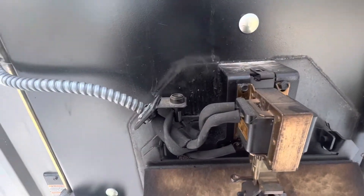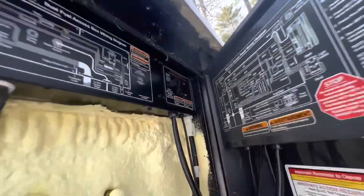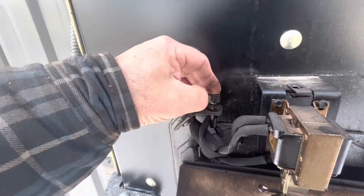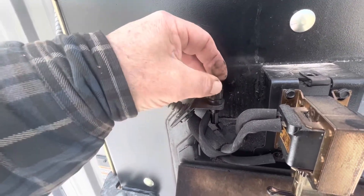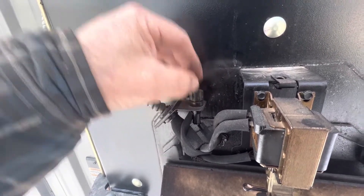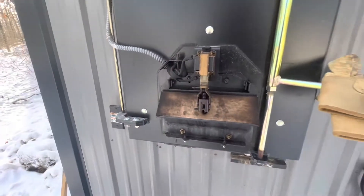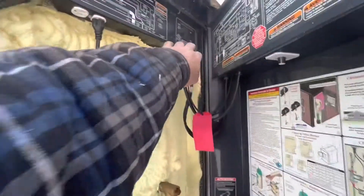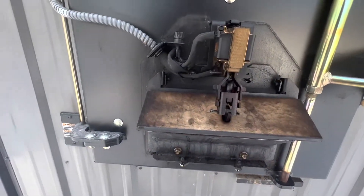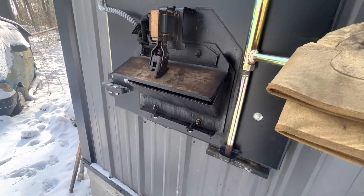So when I put this back in, make sure everything's off — yeah, the switch is off up there. Okay, I'm going to put this back in. Already that fuse seems good and tight now. It was going up and down; I could wiggle it. It shouldn't do that — there's a spring in there, it should be holding it nice and tight. So let's turn the power on. And sure enough, there it is. You heard it click, you see it go open. She's open. Piece of cake.